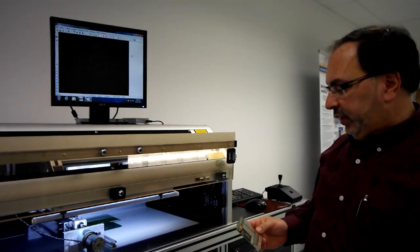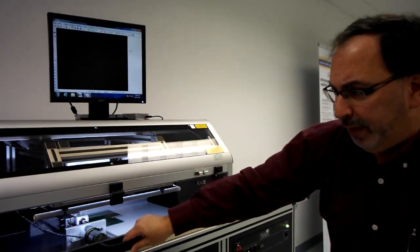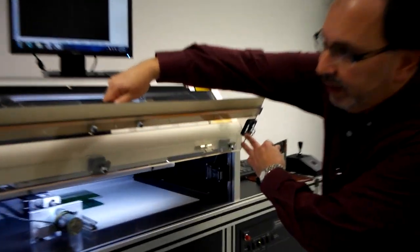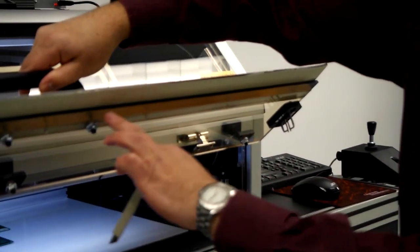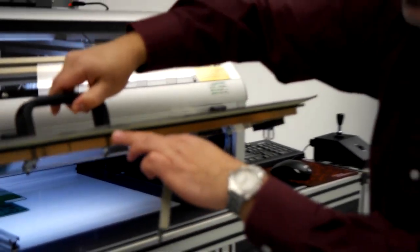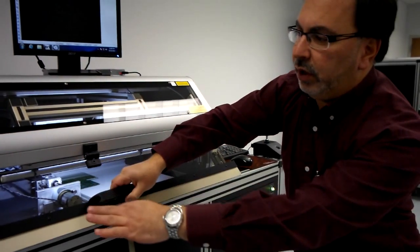This is the model RTX 113 HV x-ray system. The way the system operates is, first of all we have a front panel, and this is an interlocked panel which you can see right here. It's made out of clear lead, so this is what blocks any x-ray from scattering outside the x-ray machine, and this is also a leaded vinyl — so this is all done for protection.